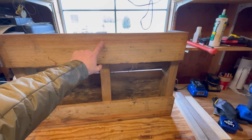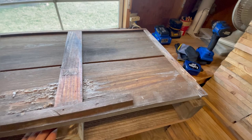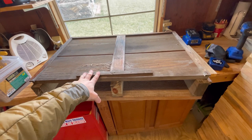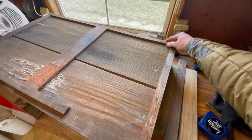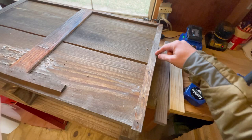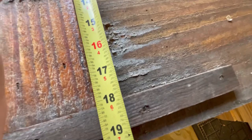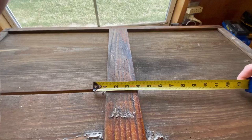Length doesn't matter. I'm putting these together with three-inch ring shanks out of an air-compressed nail gun. Then these things go into the wax tank and get wax dipped — let me tell you, they are heavy, probably every bit of 35 to 40 pounds each. That's another reason why we're still doing everything manually. Eventually I'm going to have an operation like Ian Steppler — he's kind of who I'm mimicking. We secure these down not with glue but with narrow-crown staples — about four or five, one-and-a-half-inch by quarter-inch narrow-crown staples. That makes this total length on this piece 20 inches, and this one 18 and an eighth. This piece right here is two and three-quarter inches wide.